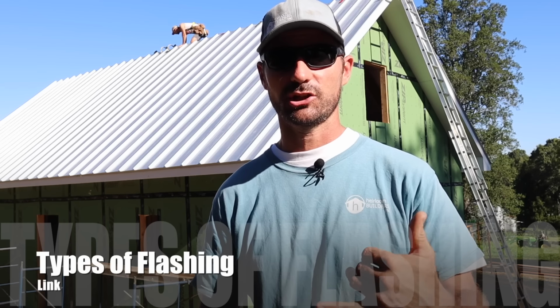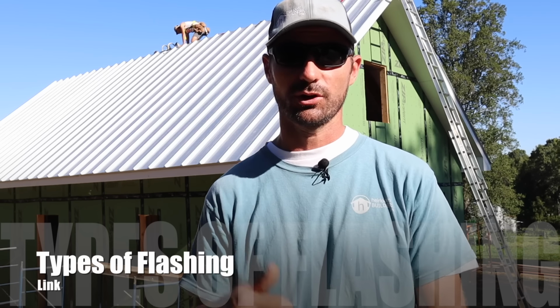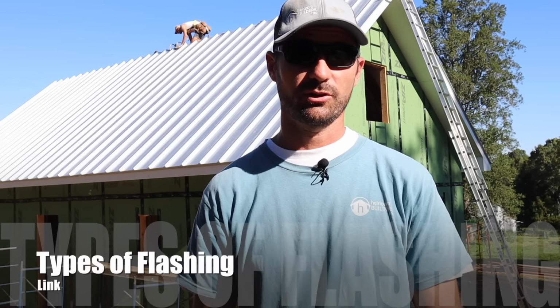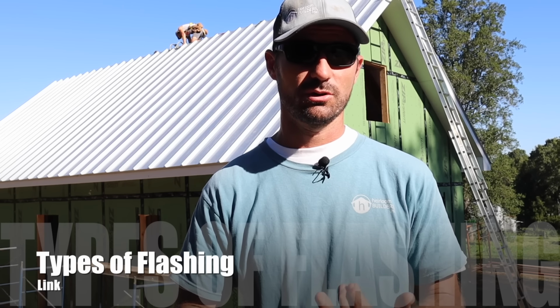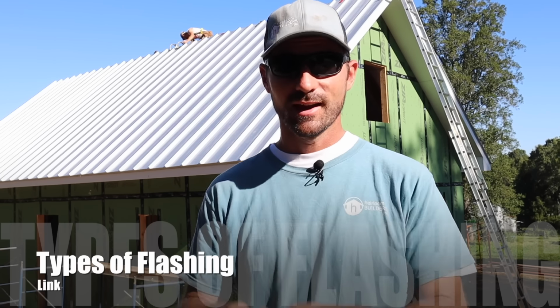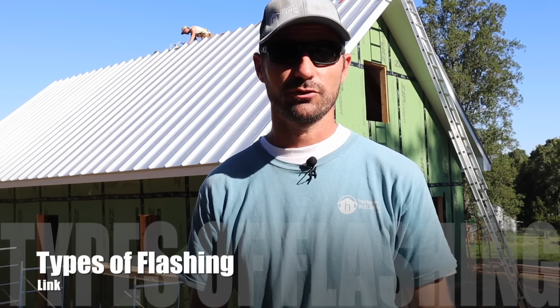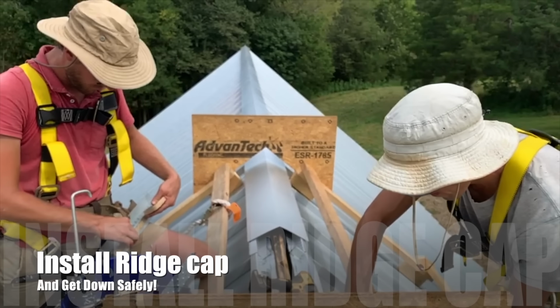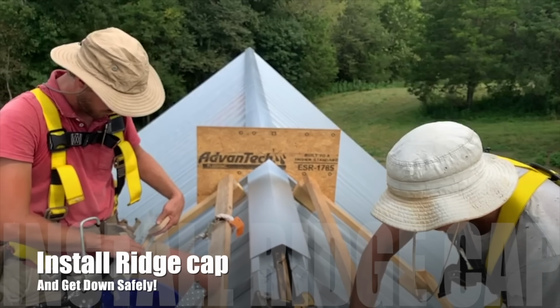So types of flashing and where you'll need them. We're going to put a link in the description below from a manufacturer's website on particular flashing so that you can make sure you've got the right ones for your roof. This is a simple gable roof, so all that we need is drip edge and ridge cap. Your ridge cap covers the gap between both ends of your roof.